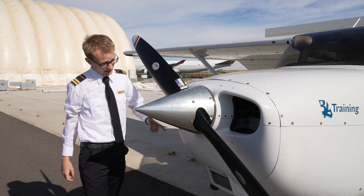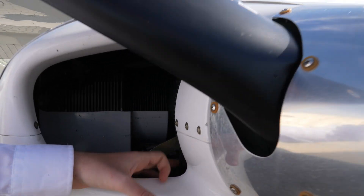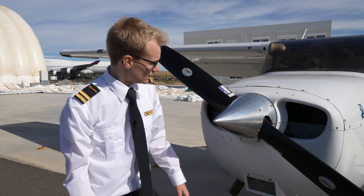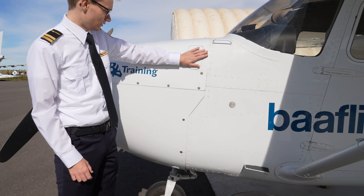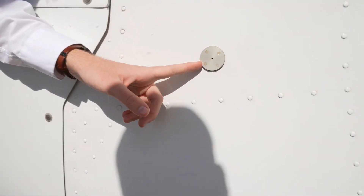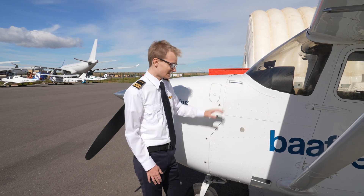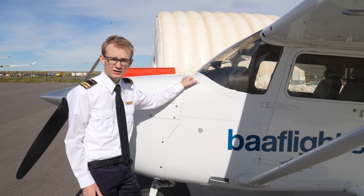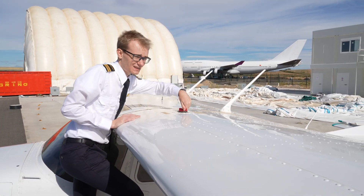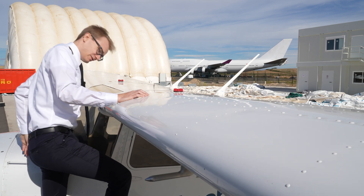Up front, we also take a look at all of the air intakes and filters. On the left side, we also have the alternator belt, where we just make sure it's still securely attached and not worn down or brittle. Moving along, we make sure all screws are in place and all access hatches are closed on this side. We also have our static ports here and we verify that the opening is clear — that we can see inside — which tells us that it should all be fine and working. Then it's basically repeating the same procedure for the other wing. We check the fuel level visually and also take a look at the upper surface of the wing and the center part of the fuselage.